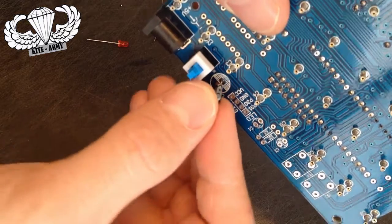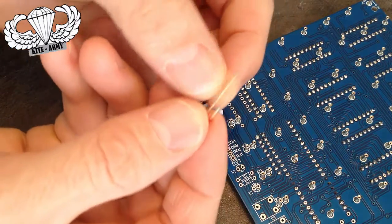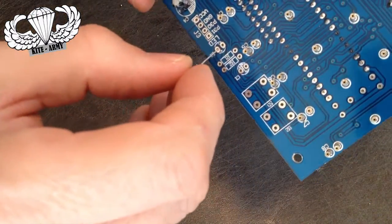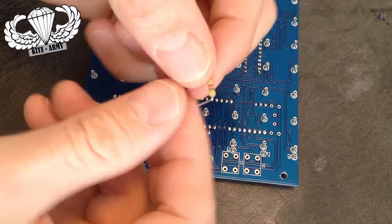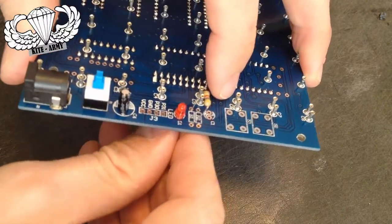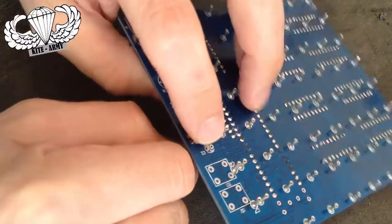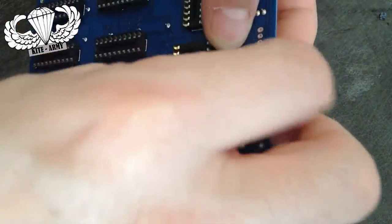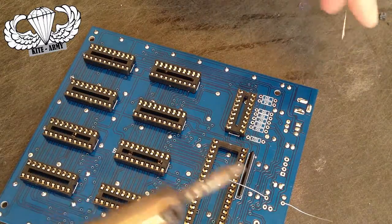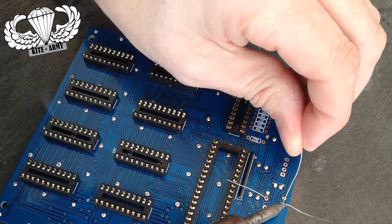Slip the capacitor into the circuit board and solder it on the other side. Here's an LED light — same thing as the capacitor: the longer leg is positive and the shorter leg is negative. You can see there's notation on the board helping you figure out what's what. Here's a little resistor — there are two of these that go side by side. They're color-coded, so look for two that are identical. You'll have another eight that go on another part of the board — one per layer. You can see them right next to where I'm holding the solder.